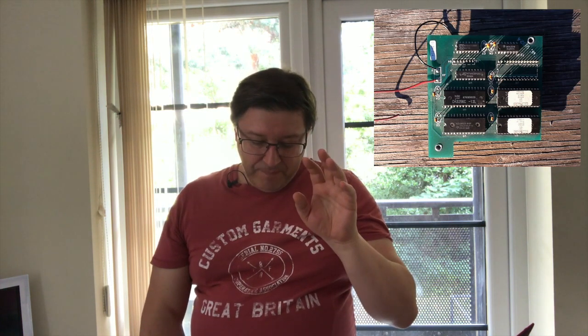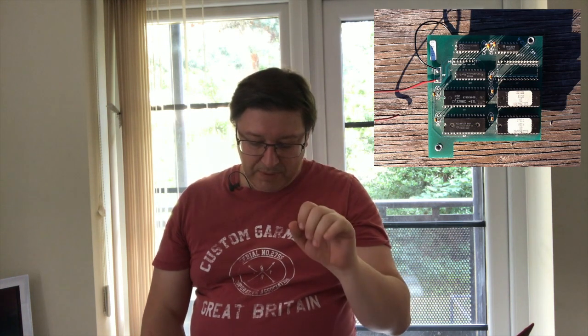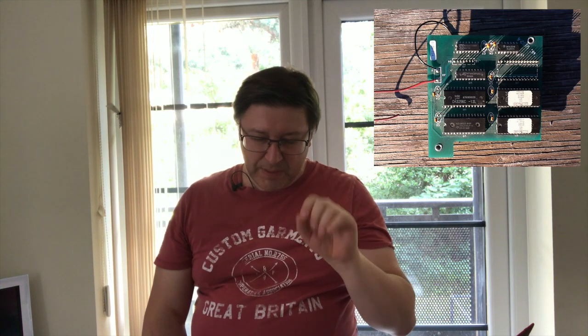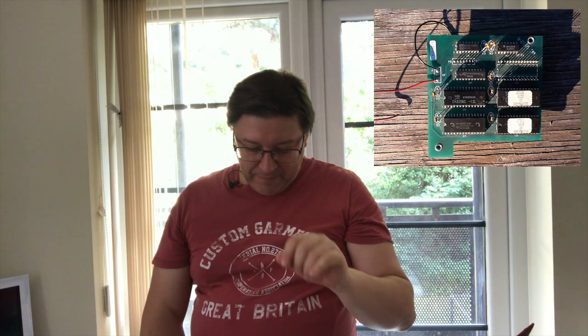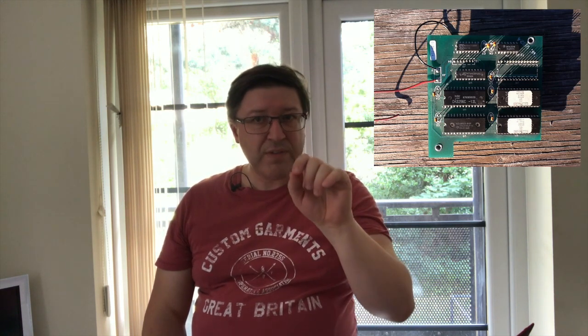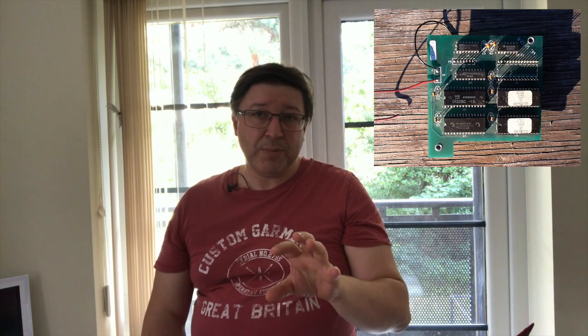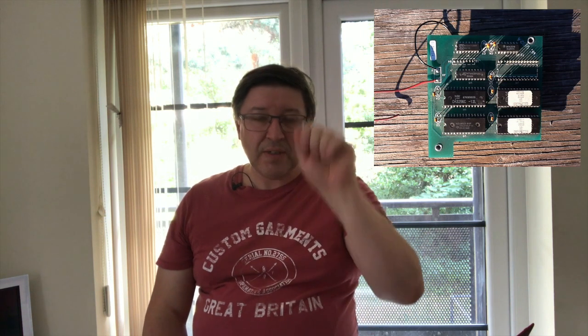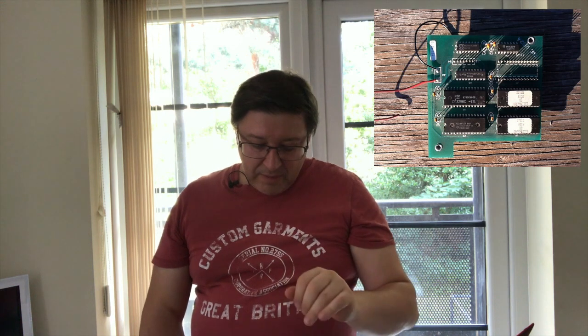As best as memory serves me, the modifications for the E-series card require you to remove two chips and replace one with a chip daughter board, and solder a fly lead or two to two specific legs of another chip. If my memory is correct, I would start my investigation by making sure the daughter board is properly seated — make sure it's actually in the IC socket. As I remember it, it comes with a chip mount that mounts onto the circuit board. The other thing I would do is look over the board to see if you've got any dry joints — look for slight cracks or lines within the solder. If you've got that, it's very possible you've got a dry joint going on.